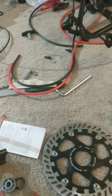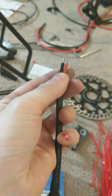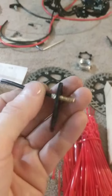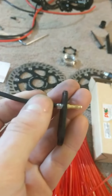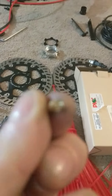You do not want your wires to be fried. This is what they supplied me with — this is 14-gauge wire, and that is not okay. I also checked the pins; these little guys here are not soldered correctly. This is what actually goes in the socket where the battery plugs in, and they were not soldered correctly.